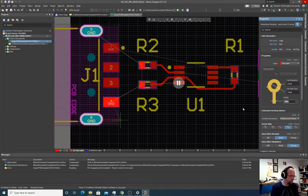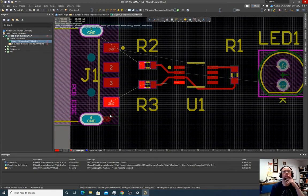I'm going to change it to something kind of fat. So I'm going to change it to 24 mil. When you take senior design, we'll talk more about the general rules for choosing width. Now you can also run the trace all the way across two pads of the same signal, and it'll connect them both.